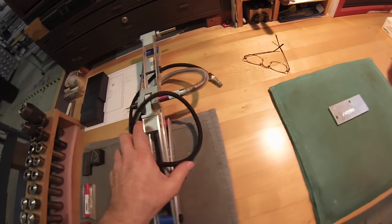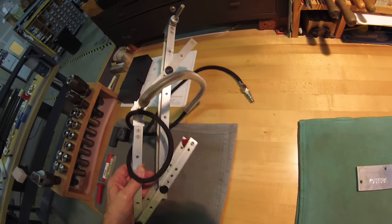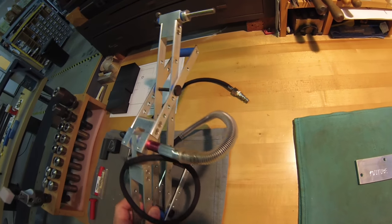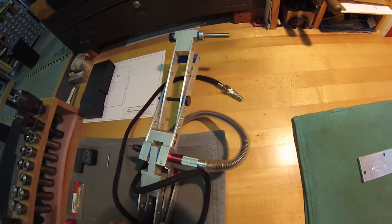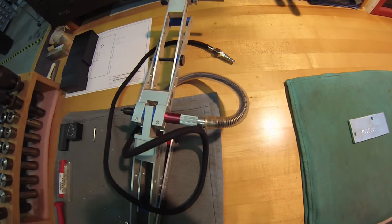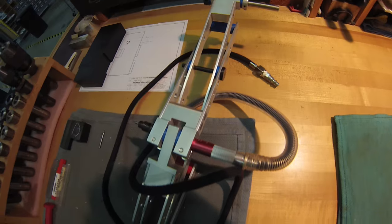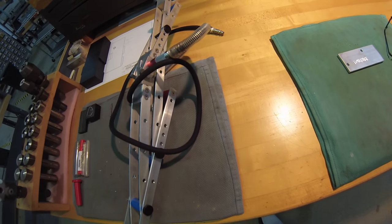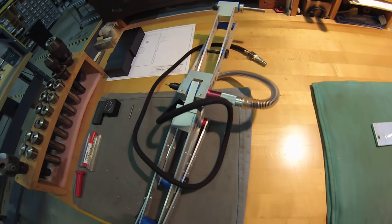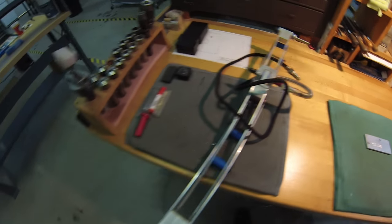This is an air-driven pantograph. And it's not very sophisticated. It's about 8 feet worth of 1/8 by 3/4, 6061, and then there's some 3/4 by 2 aluminum in here that you can see is machined to a little bit different configuration. Now this doesn't look like much sitting here on the table. So let me pop it into the machine and we're actually going to cut a part for you and you can see how it works.